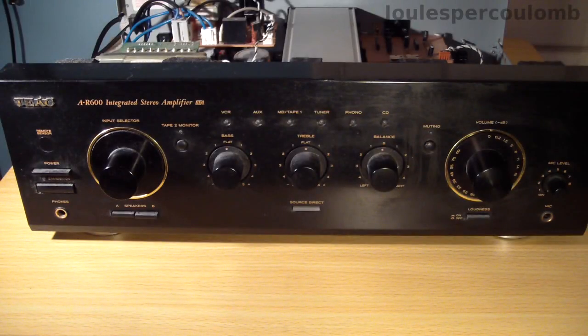Using a multimeter in its continuity test mode, I've made a few simple checks. First, I checked that there is a connection between the mains plug and the mains input circuit board at the rear. At a couple of the output transistors, I also checked for any short circuits between the main power supply rails or between them and the chassis. Had I found any such thing, then it probably would have indicated one or more failed output transistors, though of course there could be many other causes.